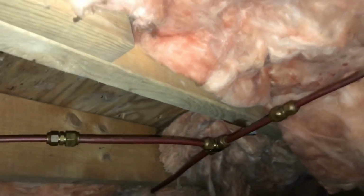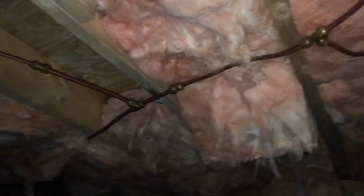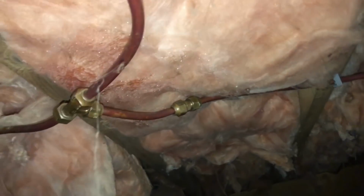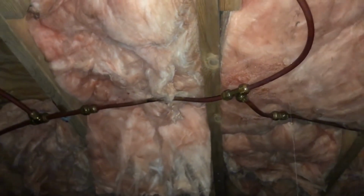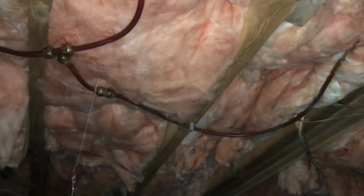Okay, I was just looking over the rest of these lines. You can see where all the bubble soap's hanging down. And just look at all of those fittings. There we go, 1/2 to 3/8 headed to the furnace. So it came in as 1/2 right there to that first T. There it goes 3/8 to another 3/8 all the way around the T. And a coupling right there. Union, whatever we want to call it. 1, 2, 3 unions. Two of them are reducing unions, so I can almost understand why they would have them at all, but not really.